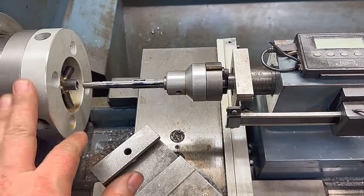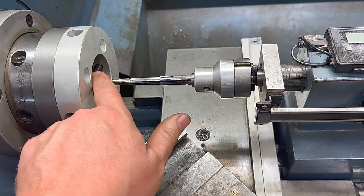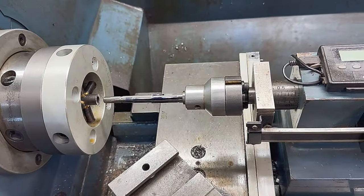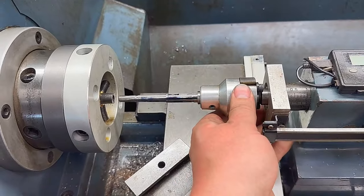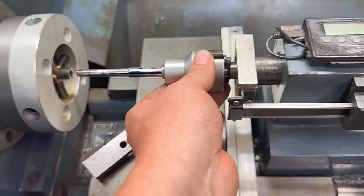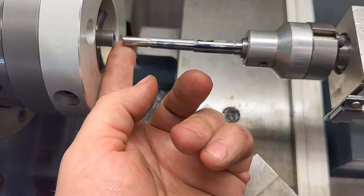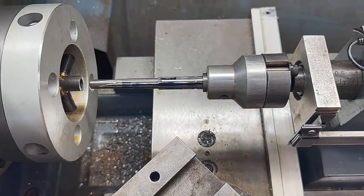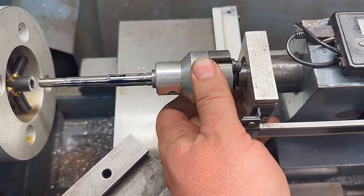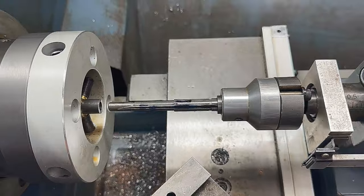Okay, so we have our liner dialed up in our headstock. We're really careful not to overtighten these set screws. There isn't a ton of metal there. We don't want to squish our liner. I've got my 3220 reamer, and this is a Dave Manson reamer holder, which is designed to float. It's designed to float to best align your pilot with the bore. This is a fixed pilot reamer. It fits pretty good with this particular barrel. And we'll just slowly start to ream this barrel. We've got it squared up and we're all set to go.